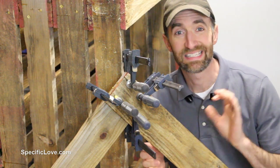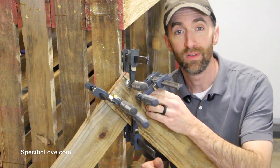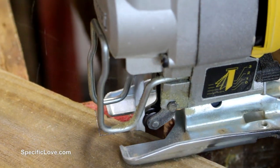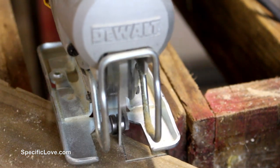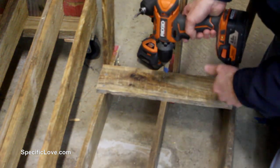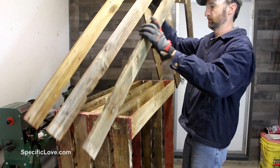Now for the roof, I had six pieces left over and I glued them at a right angle up in the corner. I'm going to put these on the roof and measure it out to make sure it fits right. I then used a jigsaw to cut a small notch at a right angle in each frame piece to allow it to sit on top of the structure evenly. I next attached all three pieces of the frame together with an additional piece of wood going across at the top, which will help give them extra strength during heavy winds.